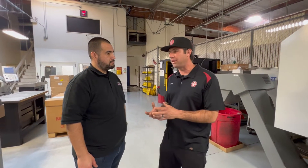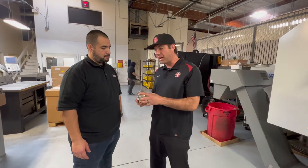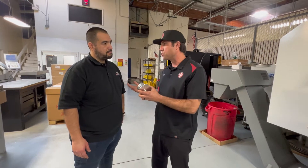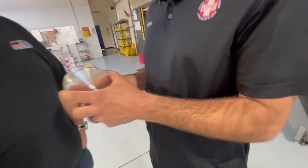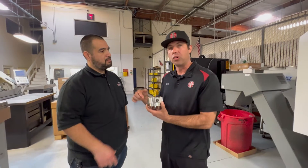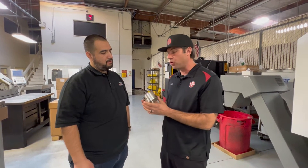You mentioned cam turn. A lot of people look at a piston and think it's round and pretty cylindrical. Let's talk about that because a piston has a lot of technology and engineering that goes into the cam turn. When you look at a piston, people think it's round, and they think it's straight — but in reality it's barrel-shaped. And also it's not round, it's oval. So even if it's a full round forging, it's got a cam — it has an oval shape to it.